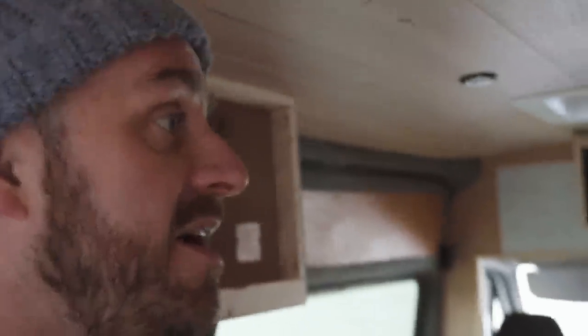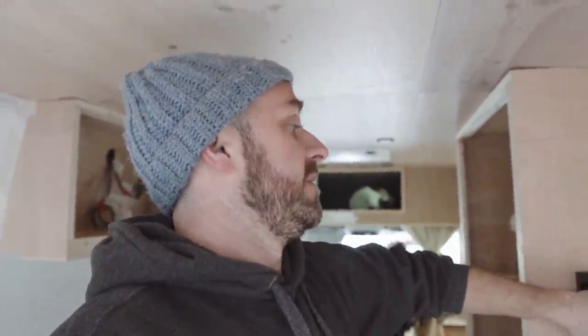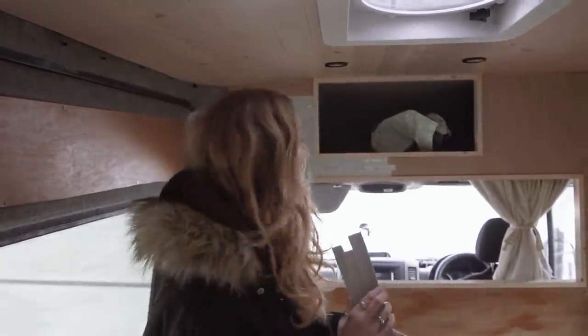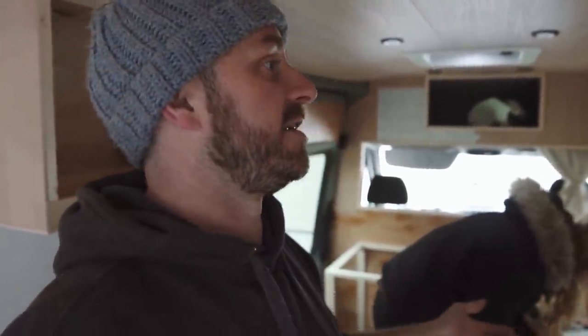Today, Chess is putting up the tiles and I have made a start on putting the 12 volts in. We've got the batteries down the bottom here. I did realise I wired the dimmer switch the wrong way around so it wasn't working - I spent ages trying to work that out. It's one of the fiddliest jobs I think I've ever done in my life. I'm just taking it very, very slow because it's very easy to mess it up and I don't want to have to spend ages peeling them all off again. We've got progress from last time - remember last time we got to here and it cocked up. I don't really need to do the 12 volt thing yet, but I think it's best to get it all wired up and make sure everything's working because we don't want to get too far down the line and realise I've cocked up somewhere.